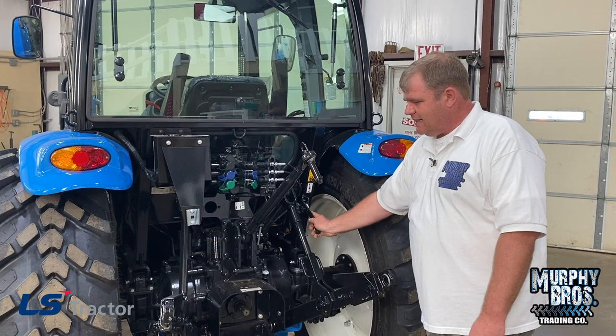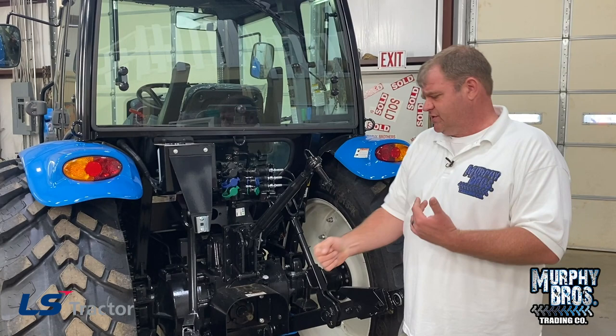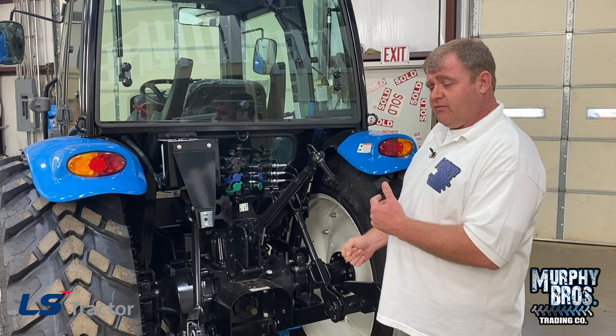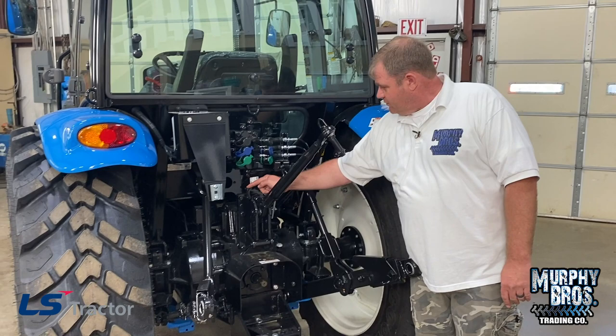This one is a little bit different — it's got a keeper here. You pull it out of the keeper, line up the peg, let it down, and if it was running you could raise it back up. Love that feature. These tractors do come standard with draft control or depth control. You can decide how shallow or how deep with the draft lever beside your seat on your hitch — not the position lever. If the plow wants to go deeper and deeper, you pull it back some and it's going to keep it shallower. Draft will not work until you unlock it.